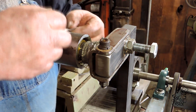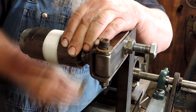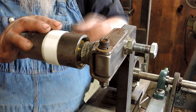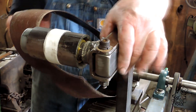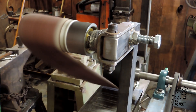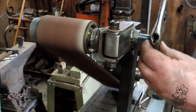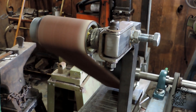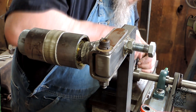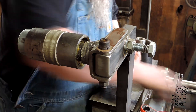The first thing we're going to do is take a little surgical tape and run it around the center of this tracking wheel. What that'll do is raise the center of it and it'll act like it's sort of tapered off on both sides. It's a trick we used to use in the lumber industry on conveyor belts to get them to run in the center — that's going to sort out the tracking. We'll do a more permanent solution later on, but to get us through this for now.